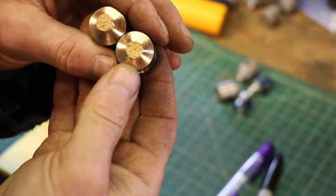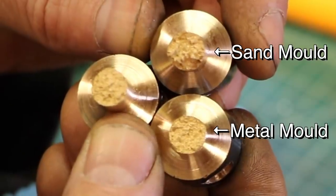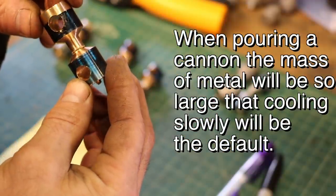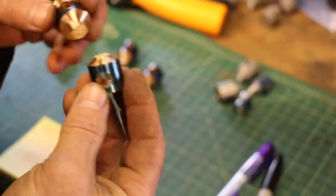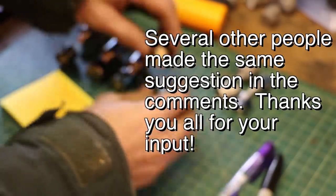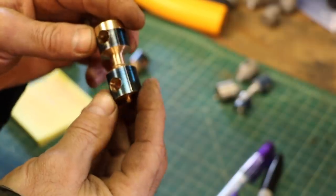This is the one that was the sand — even on camera I think you can see that. Cooling it too quickly is an issue, obviously. Maybe this is actually stronger than I'm giving it credit for. Sure enough — it broke right at the corner. This one broke right at the corner. This one broke right at the corner. And the one from last video also, right at the corner. I think Brandon may be on to something. I need to make my sample with a smoother transition and a nice radius there, so it doesn't give a stress point for it to fracture.